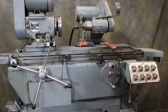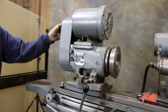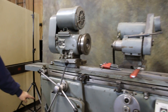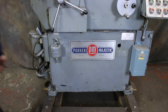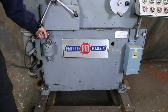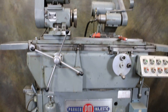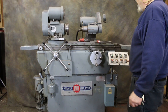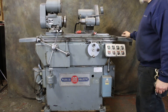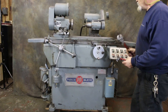Again, this is the spindle, the work head. The work head has different speeds via your belt here — if you change the belt, you get a couple of different speeds. Your coolant is built into the machine, slides into the side. This is a big gusher pump; the tank is underneath. This is your lubrication.